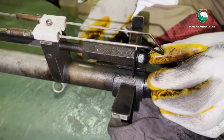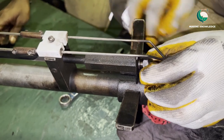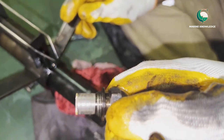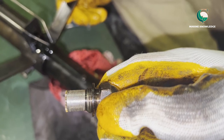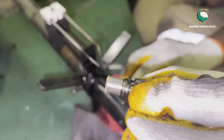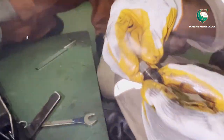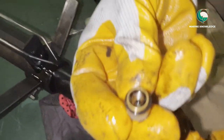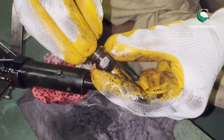Open the atomizer using proper tools. This is the pilot atomizer which already has a very fine filter attached. The filter can be removed by unscrewing — it is a screw type. First we open the pilot burner and then remove the filter. Just unscrew it; the filter is out. Be very careful with the washer. The filter is basically clean but we will do an air blow to clean it.